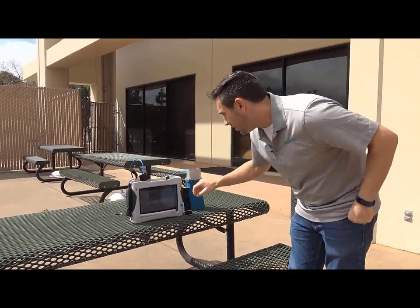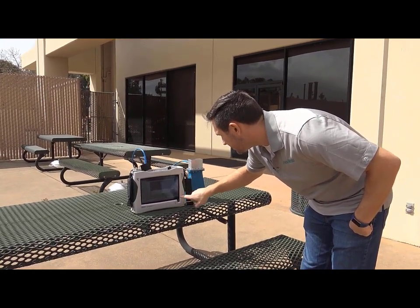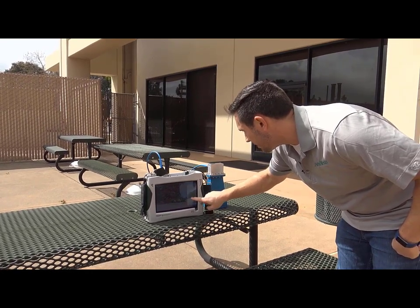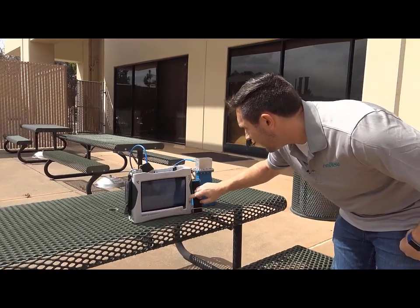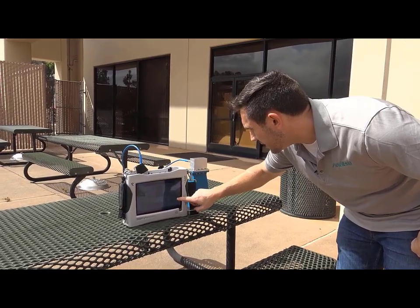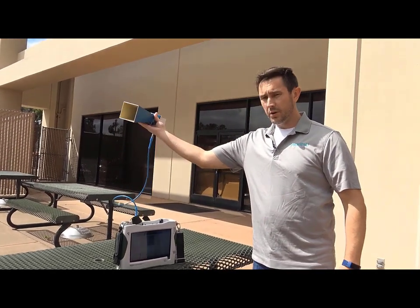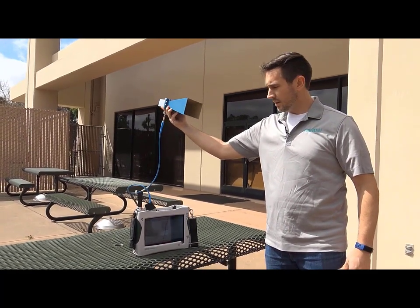The nice thing about the interference mode is that it gives me an audio tone for the signal. I'm looking right now at a 65 MHz band — I'm sorry, 65 MHz band. I want to do an integration band a little bit narrower, something like a 20 MHz integration band on that signal. Then I'm going to set up my tone. I'm going to turn up the volume a little bit. What will start to happen is, as I start to point towards that signal, I'm going to hear that tone getting louder and louder.